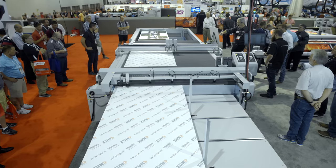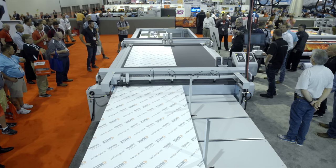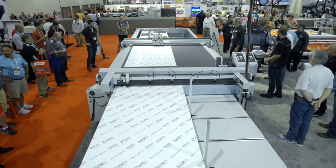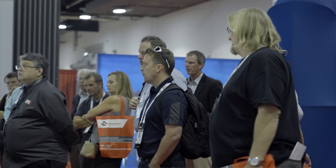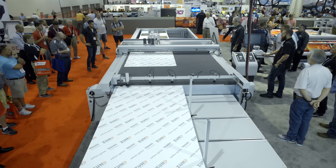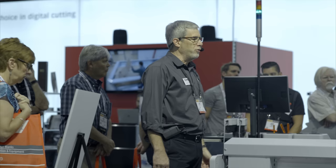We're going to read again — first read the guide edge, and then we'll read the gripper edge. Since it did that on the front, it knows where the print is in relation to those edges on every board in the stack. So it knows that it's going to have to cut the sheets exactly the same, and we can feed them upside down.